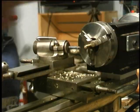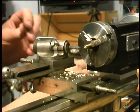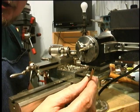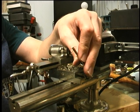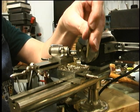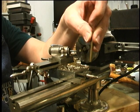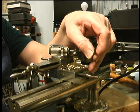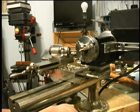To make up washers, I've got these little brass telescoping tubing in all sorts of sizes, that you can just run in a drill press and hold a file or sandpaper and sharpen them up. You can use a sheet of kind of thick hard plastic available as shim stock from machinery suppliers, and spin this in a drill press through the plastic and make a little hole, and then go up a size and make a kind of donut shape out of the plastic by using 2 different sizes of these, and you can make yourself up a little plastic washer. You can also use Teflon tape.